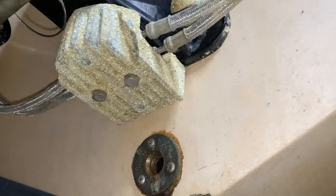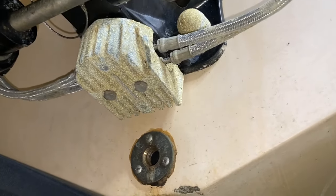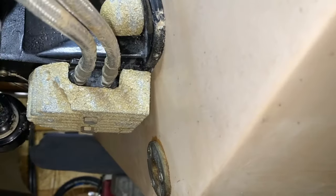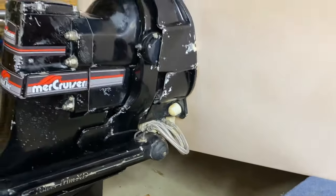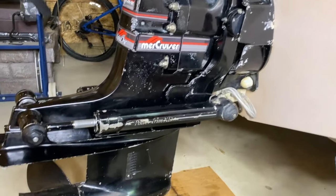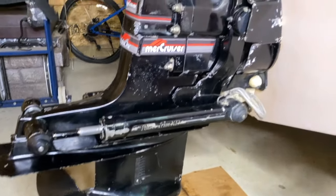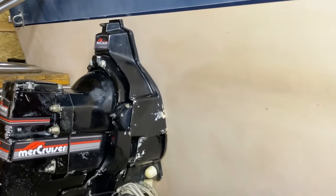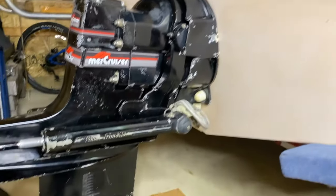Let me give you a better view of them. They have done their job — look at that. The main purpose of your anodes is to alleviate corrosion to your transom, gimbal ring, bell housing, and outdrive, and everything else that works in relation with the system out here — or in other words, on the outside hull or rear portion of your boat.